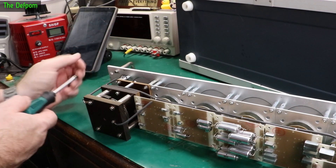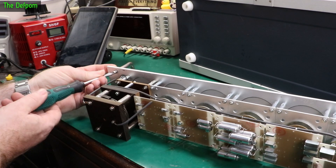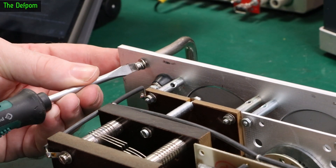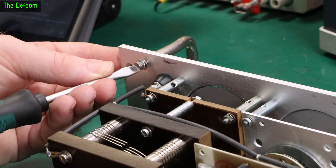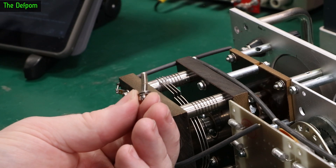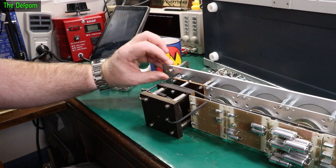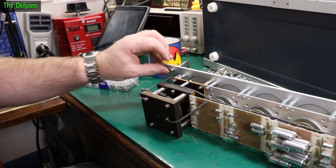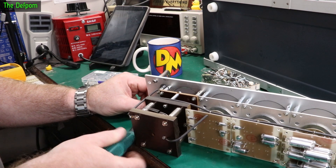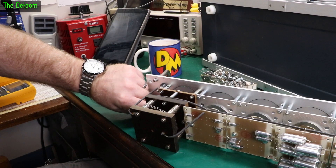Looking at this handle, I notice it's not straight, so I'll try unscrewing the screw to see what's happening. Yep, the screw is wobbling everywhere as I unscrew it — it's slightly bent. I found some M4 bolts which will fit in there quite nicely. The bottom one needs changing too — these are hexagonal instead of slotted so they don't quite match the original, but it's better than having a bent screw that's been stressed and could potentially fall off.